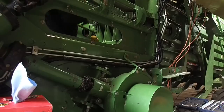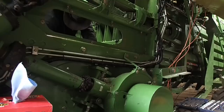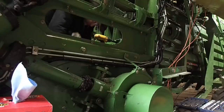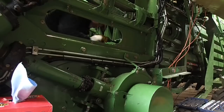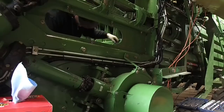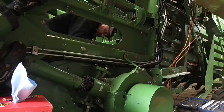These bales coming out of this baler are shorter. I was at 102 inches with those bales off the New Holland baler. These bales are 92 inches long, and I'm putting 1,450 pounds of hay in each one. So there's more material going through these balers than there was in the New Hollands when I was running the New Hollands.